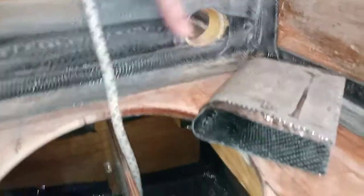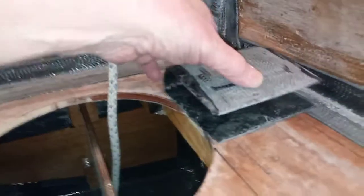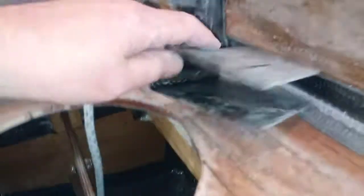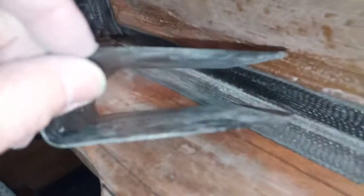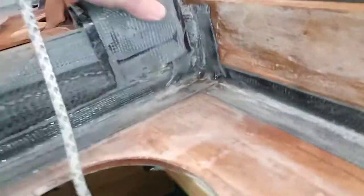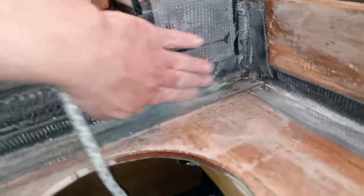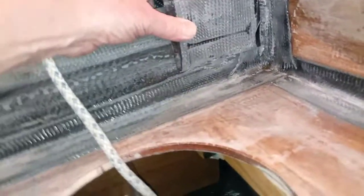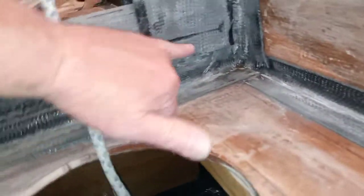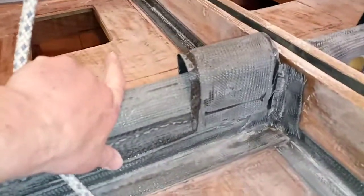Once it's all flush, this clip will slide over the top. I made the inner part of the clip by casting it over this piece and then putting a couple of layers of carbon fiber over the top, holding it down so it would end up being more this sort of shape. It's got a little bit of spring tension so it just slides in, and most of the time it'll be fully in place with smooth surfaces meeting against each other. Even if there's a lot of water in here, it shouldn't get into the cabin area very fast.